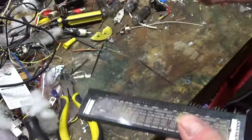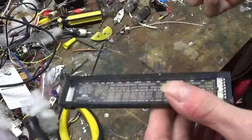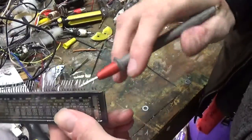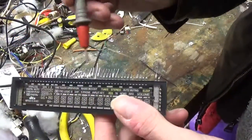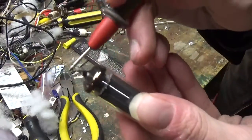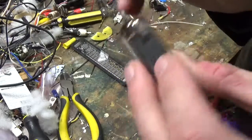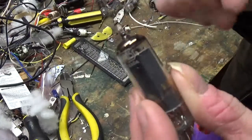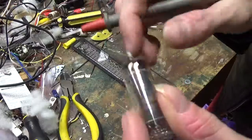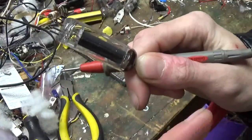But you'll find, especially in older things like the spell check he's working on, you'll have the wires for the segments, and then there'll be this little nub, and it'll look something like this. Just like this. It'll look kind of like the end of a light bulb sticking off. That's the seal. That's your envelope. That's where the glass rod was attached to the tube during manufacturing.